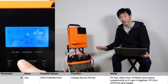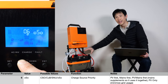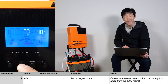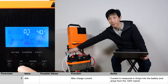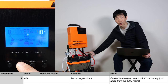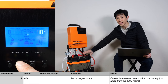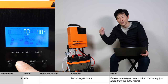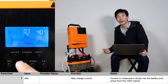Different modes make it more intensive for using the battery, or you can use it more like a battery backup system where most of the time it's charged up — if the AC mains cuts out, you have stored energy. Max charge current is 40 amps. This is measured in how much current is going into the battery, not how much current is coming in from the AC line. The AC line is at a higher voltage, so it registers at a lower current. You want to set this at whatever your battery manual says is reasonable — you don't always want to charge at maximum because this generates excessive heat and lowers battery lifespan. Slow and steady is the way to charge these batteries.